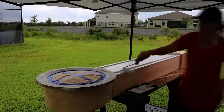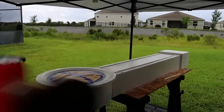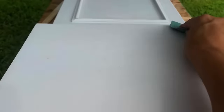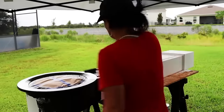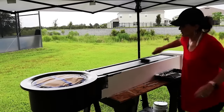Once fully dried we went into priming. I primed it really, really well, making sure everything was covered and let that dry. This is an opportunity to go back and sand a little more before you add your actual paint. Now we get to finally do the fun stuff! I covered up the clock face the best I could, taped it off really well, and then added our paint — the same paint I used on my hutch. Three coats of paint in Caviar, which is in a cabinet enamel, and this is really important as it helps with durability.